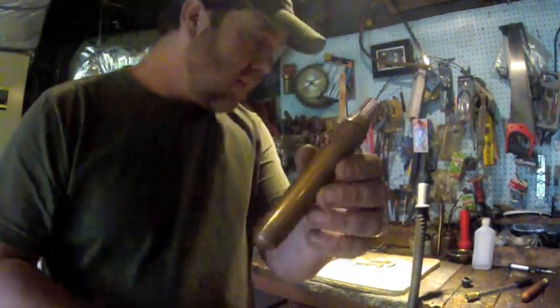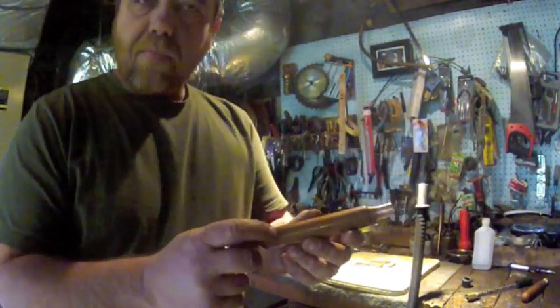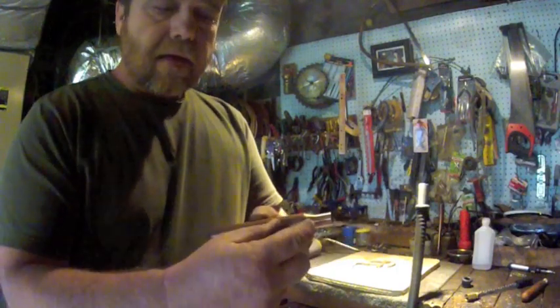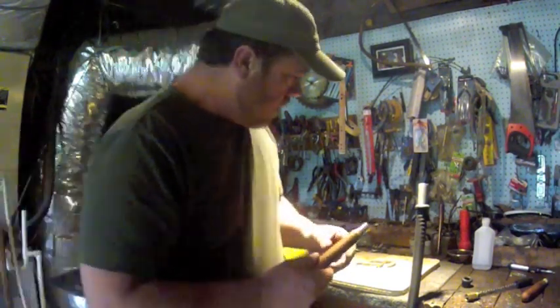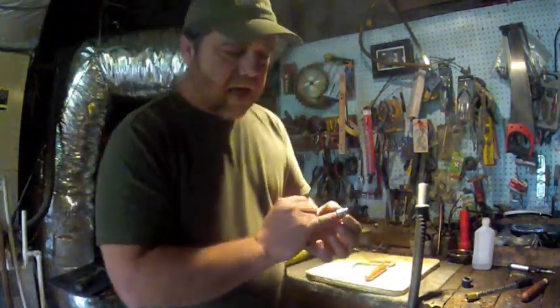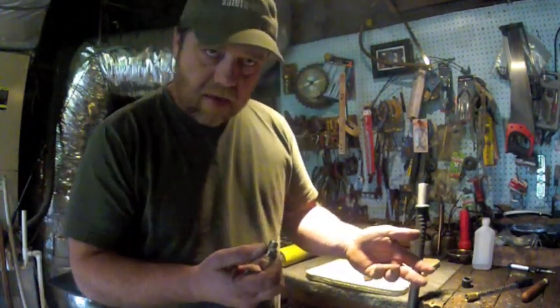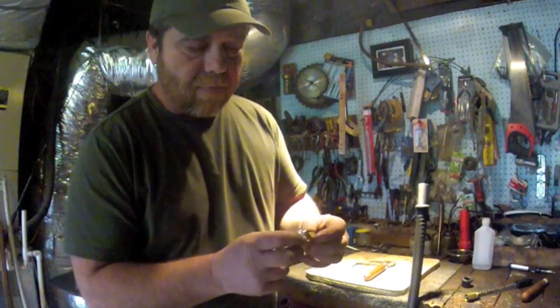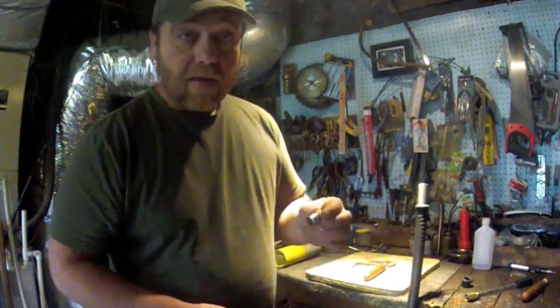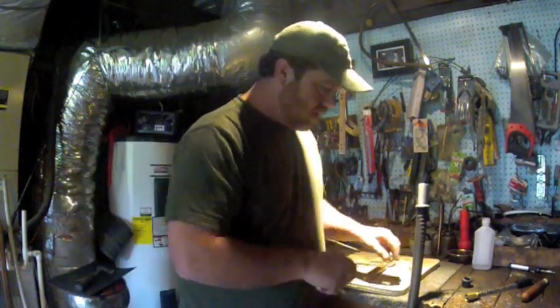Basically, like I said, it's just this air chamber right here, and I'm going to scoot you a little closer over here when we solder. It's an air chamber that you can get in any plumbing store. You can duplicate this with a 3/4 cap and a 3/4 by half reducer in any length of tubing you want to put in the middle here. And this here is just a 1/2 inch sweat fitting with a 3/8 compression on top. I've discarded the nut and ferrule that comes with this, and I've got an actual cap that I'm going to pop an O-ring in that's going to seal this thing up good so it won't leak and you won't lose your fuel, won't get any alcohol burns, or destroy your pack.